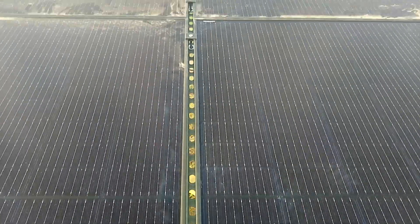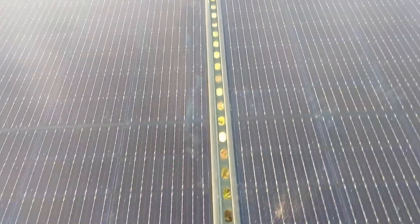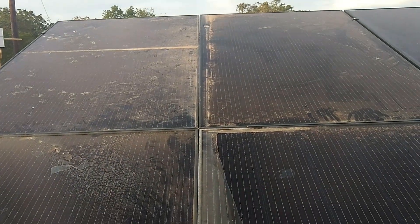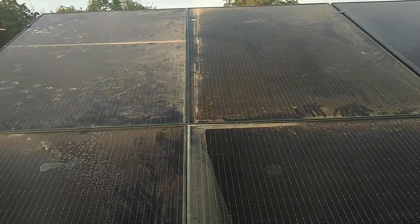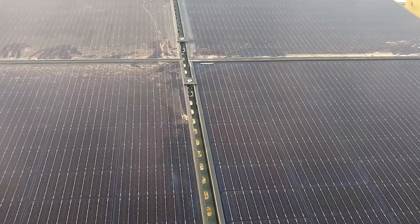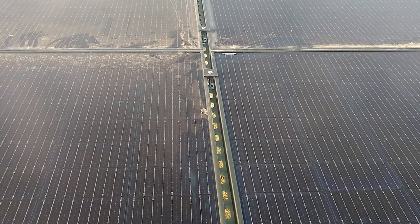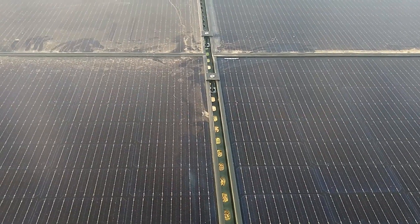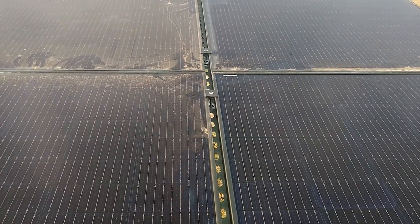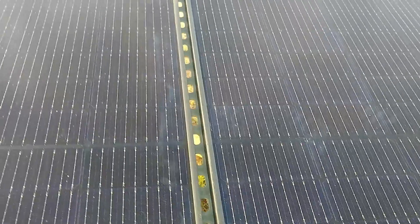Over here I've got the mid clamps. I don't know which way I like better. With the mid clamps we get a space in the middle, which I don't know if I like that or not — this looks a little cleaner. The panels don't look too clean, but we can take care of that. I might just make some more of those U brackets and do the rest of them like that, because with the mid clamps it's kind of hard to get at that last one there — the bottom top clamp — because you have to put your finger underneath and hold the nut so it doesn't rotate. It's just a lot easier from underneath. So I might do the rest of them from underneath. Save a little space too.